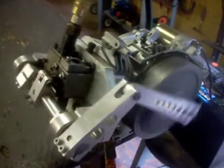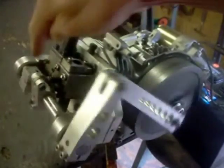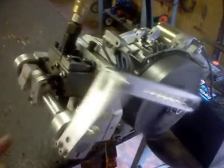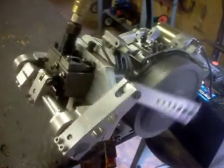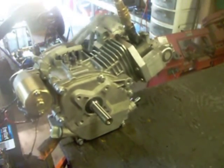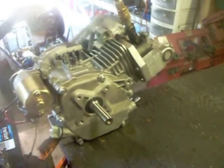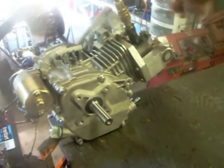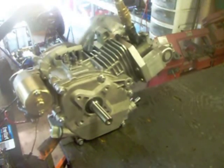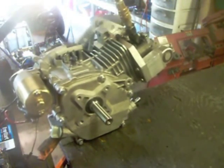This is running on about 25 to 30 PSI, and here you can see the link going around, rocking the shaft and activating the exhaust valve. The inlet valve operates from underneath — you can't see it. This is the power takeoff side. All of the levers are taper pinned to this shaft, and I use Loctite on all the connections, because I usually run this engine at 2500 RPM and haven't had any problems with anything coming loose.